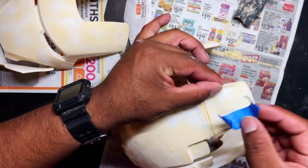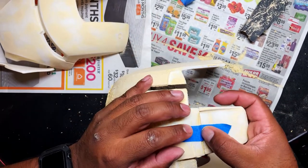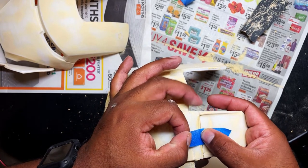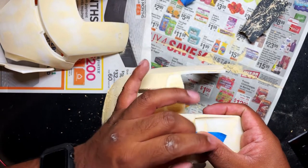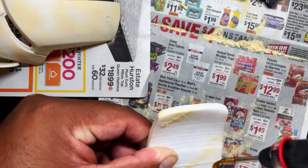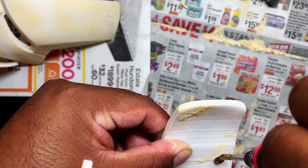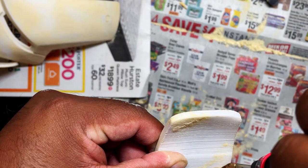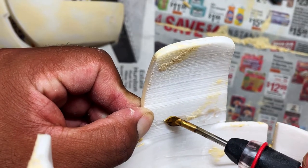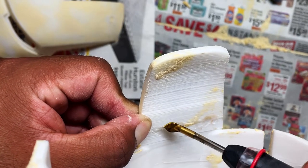What I'm going to do to try to fix this is put some painter's tape right here. All I need is for it to stay in place for just a second while I plastic weld it back together. I'm going to put this right here, take my little melting tool, and try to get it back together. This is just to get it to stick, and then I'm going to take some leftover filament and fill in the spot to make it more rigid and reinforced.